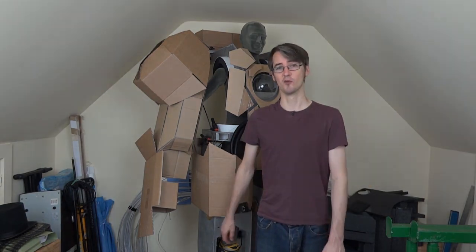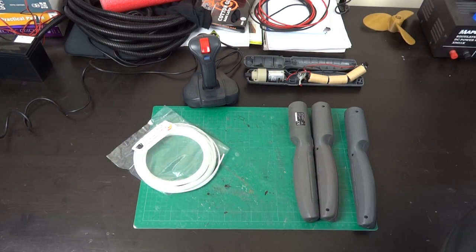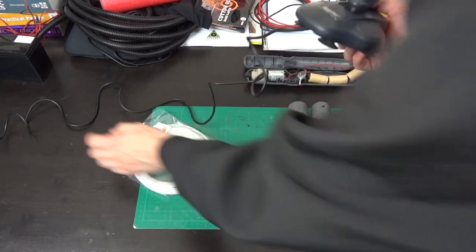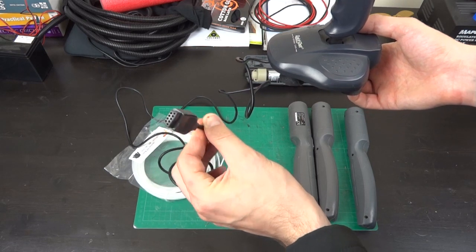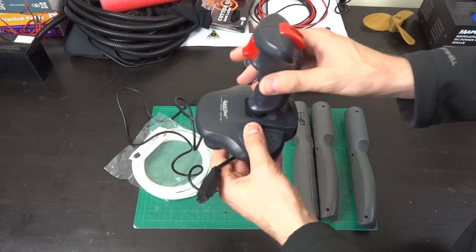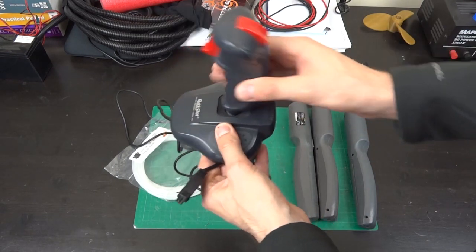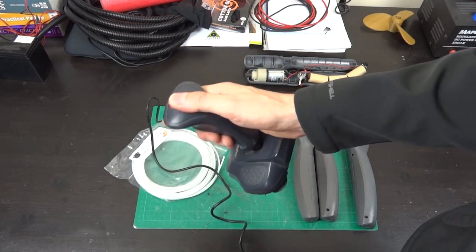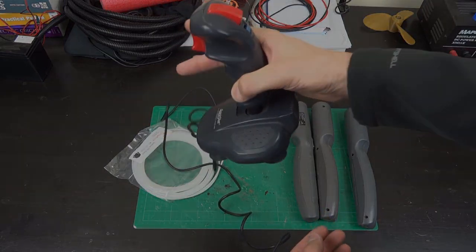We also need to sort out the elbow joint. My hands are going to be mechatronic, which means I need four motors in them so they can be activated. I've got a pair of old clicky joysticks with a nine-way plug, the sort of thing you'd have on an Amiga 500 or Atari ST. Those have just got switches in them. I'm planning left and right for wrist rotation, backwards and forwards for elbow bending, one fire button for gripping, and the other for operating weapons — as long as I can operate them with one hand.